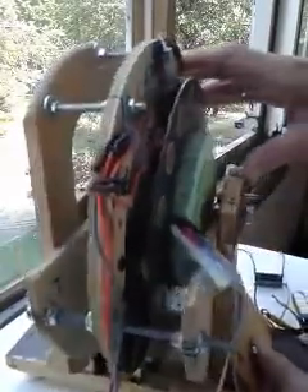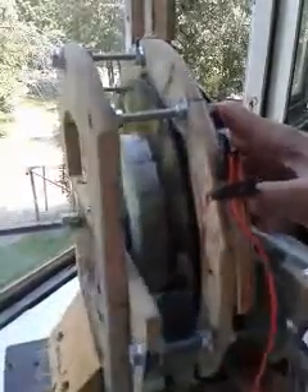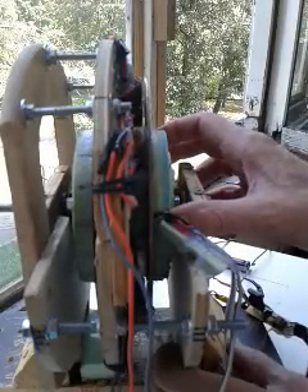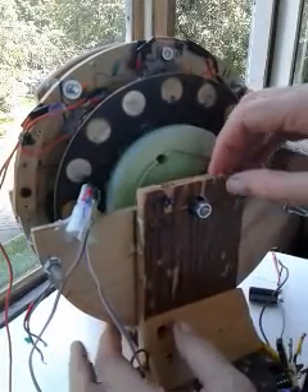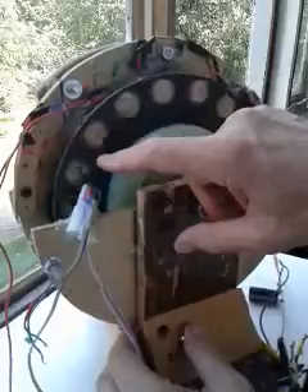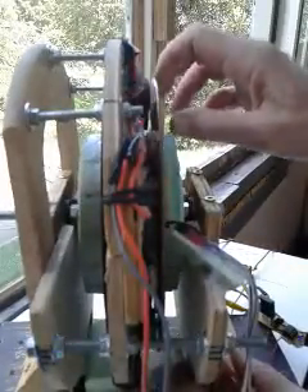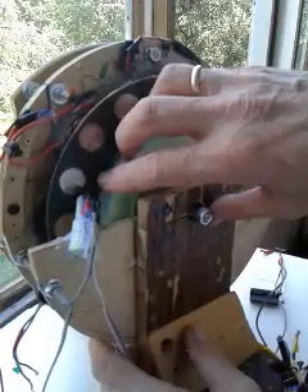This is an even more efficient motor design because the coils are squeezed by magnets on each end. When the motor coil fires one end of the core, it will also push or pull the magnet on the other side, so the coils and cores are doing twice the normal work. I have a Hall effect sensor timed right off the rotor magnets. These magnets are very thin — only about two millimeters thick and 20 millimeters wide.